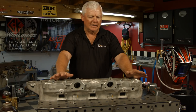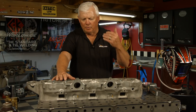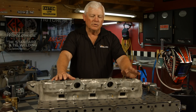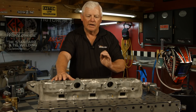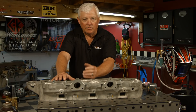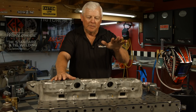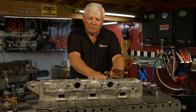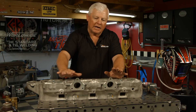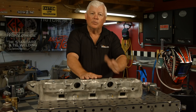The only unknown is how dirty the casting is. You've provided a very clean casting, and I'm going to take it apart, prep it, and show you how we would do it. One of the things you're going to see me do is a welding test long before I ever actually get on the part. The reason for that is when you start welding on the part, it's typically dirty and nasty — you may think it's your machine, but it really is the casting. I'm going to set up a flat plate, set my cleaning action on my machine, and then I'm going to tack it, prep it, grind, and show you a couple little tricks of the trade.